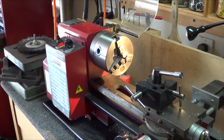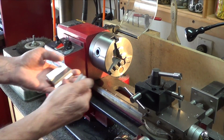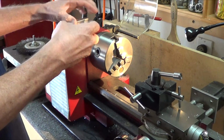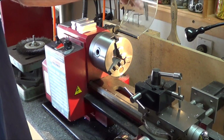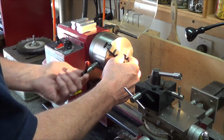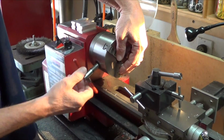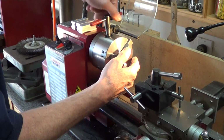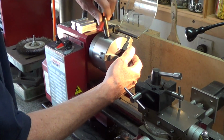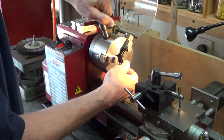Alright, here we are back again. So I've got all three of them cut into almost equal pieces, and you get to try to fit them in here. I know with the tolerances that I held, some of them are going to be real tight. I'm going to have to deal with it with sandpaper. Also, I'm going to have to get out the stamps and stamp the 1, 2, 3 in them if I'm going to try to match them.